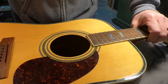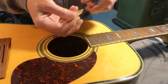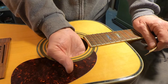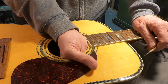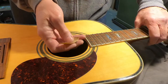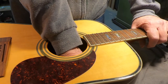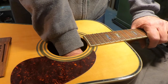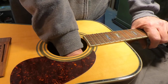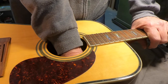Now, I'm going to put a cleat, as I mentioned earlier. I want to cleat underneath these things because they were cut short of the kerfing, and especially the X brace, maybe not so much this one, but since it was loose, I'm going to go ahead and put a cleat under it. So right on top of the kerfed lining, I am going to put a cleat. And so right now I am just sanding the kerfed lining right under the cleat. Right under the brace, I should say.